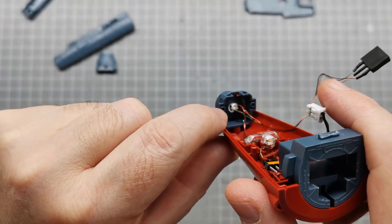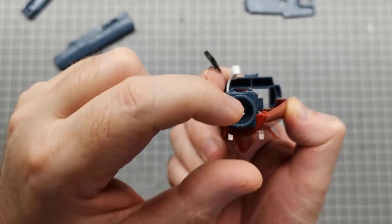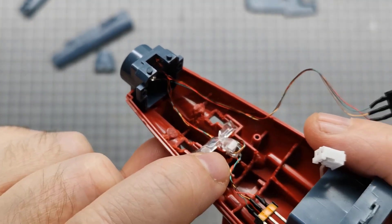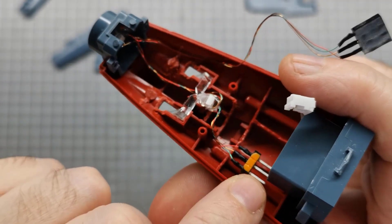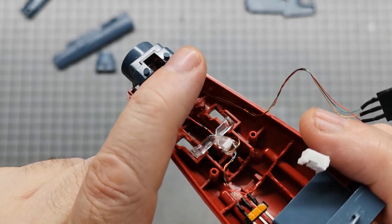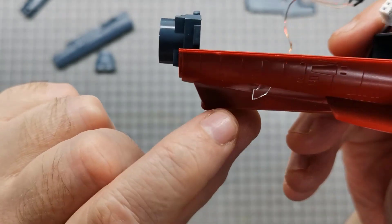I've started work on the rear of the ship by sticking another addressable RGB LED on the back. There's a light pipe that travels through into the main rear thruster. The wires feed to another RGB LED in the chain. This three-pronged plug will connect to the Arduino and that'll be the start of the addressable LED chain — so this will be the first one, second one, and then this lead will connect through to the rest of the chain. This one is attached to the light pipe that travels underneath.